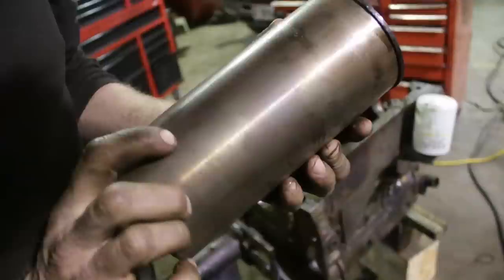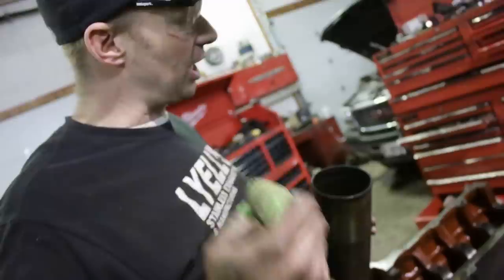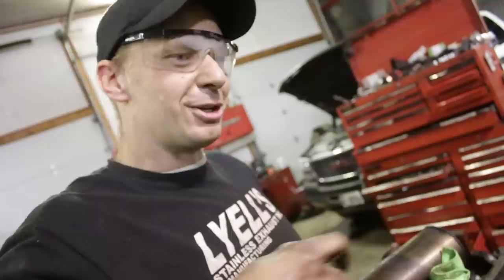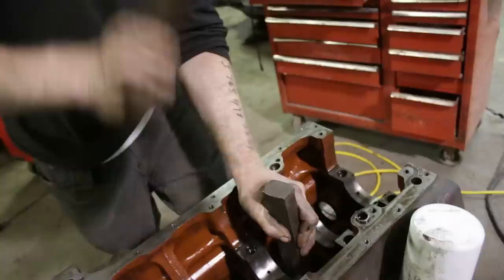This is the liner, and you can see a little spot there, but other than that it's pretty uniform throughout. If this did have Loctite on it, there is zero chance of tapping that out with a hammer. We had the hydraulic press on engines that have had sleeve retainer, and it sounds like a shotgun going off when that initial crack comes out. You're watching that gauge needle go up — scary stuff, but this one was no problem.